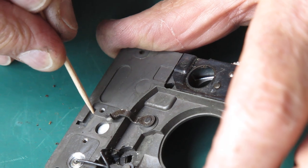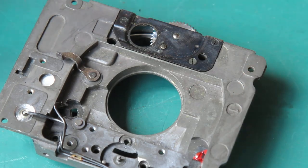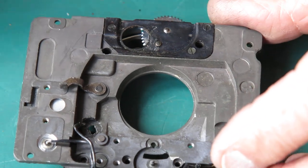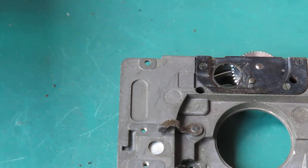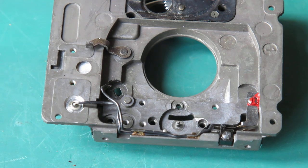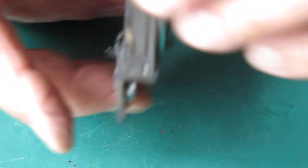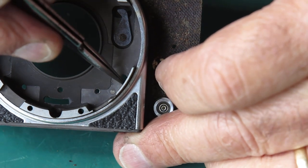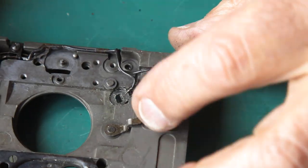It doesn't look like it goes all the way through, but there's certainly a mark or indentation there, and there was something sticky in it — like a little piece of adhesive that had come from somewhere and fallen in there. That's what would have caused that spring to get all mutilated, because almost certainly it was stuck in the hole, and when pressure went on the top it meant the spring wasn't free to compress normally — and that's what's caused it to go bad. So we should have a smoother shutter operation once we're all back together. I can tell the casting here has been cut out slightly — that hole's bigger than usual, almost certainly to accommodate that thick piece of insulation they poked through.